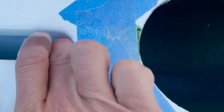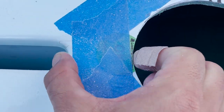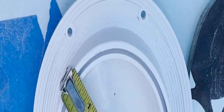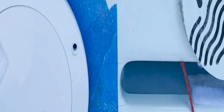We were worried about getting this too close to the structure here. We originally had it right about here and we moved it back. We're probably two inches from the front of the case — but that was the right move, because you can see right down in here the structure on the back of the board. So we actually made a good call by moving it back an inch. This takes a rough opening of four and a half inches for the porthole, and about two inches from the centerboard to the hole — that was enough to avoid the structure of the board.